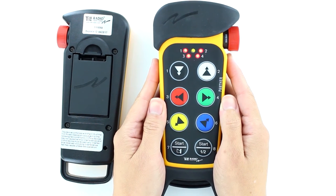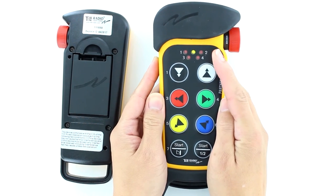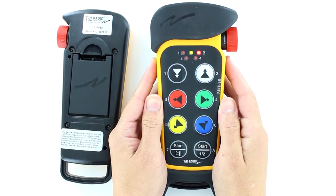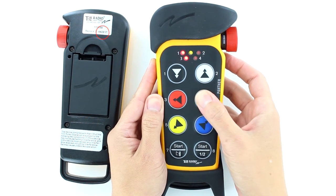Within one minute of entering the four-digit code, press button 3. The green LED stops blinking. LED 2 flashes red. Enter the Replace ID for the transmitter being replaced by pressing the transmitter buttons.